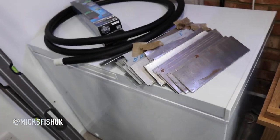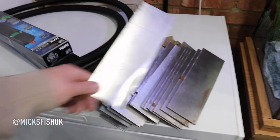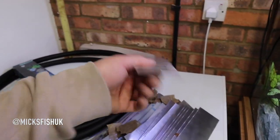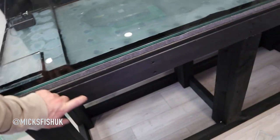And you're going to need yourself some shims. I've got all metal shims which I use to level big sliding doors and bifold doors at work — these are really good, high quality stuff, all machined up. But you can go out and get wood ones, PVC ones, plastic ones, whatever you can find. Wood ones are pretty good to be fair, you can get a tapered wood one and wedge it in there.